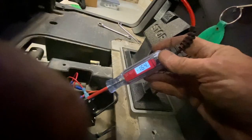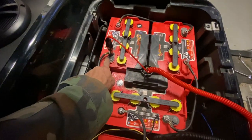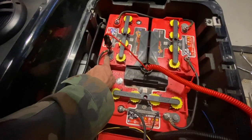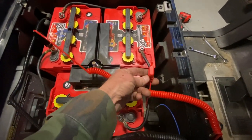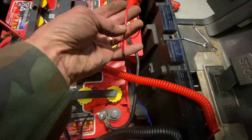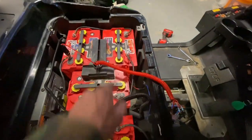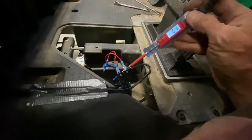Now let me tell you why I'm getting 16.4 volts on this. The headlight system on the lead acid batteries uses 16 volts - everything goes through your negative. If you hook two batteries together, eight and eight is 16 volts. And here is my wire fused for my headlights - yes, the red turns into blue. That's the reason I'm getting 16 volts. One more time on my circuit breaker: I'm getting 16 volts on both sides.